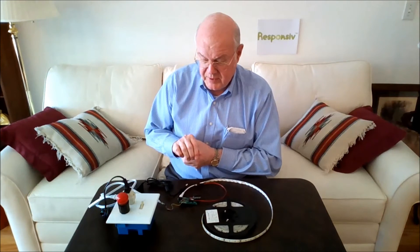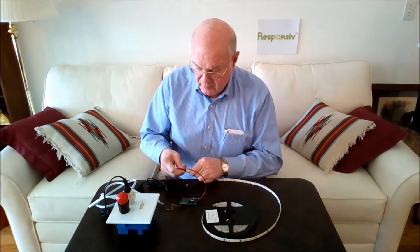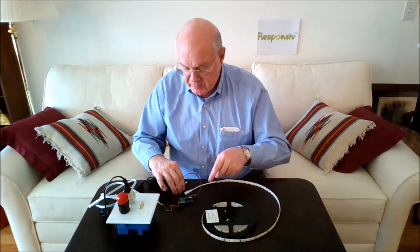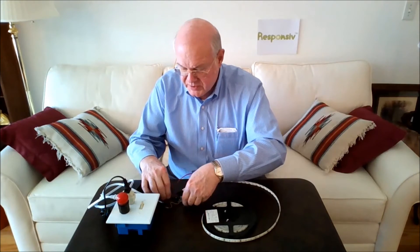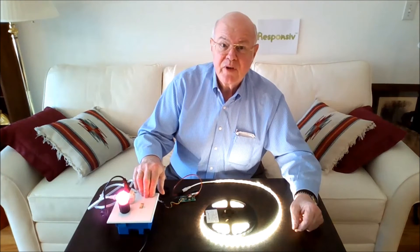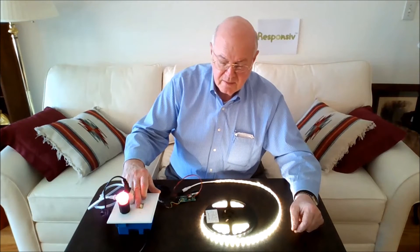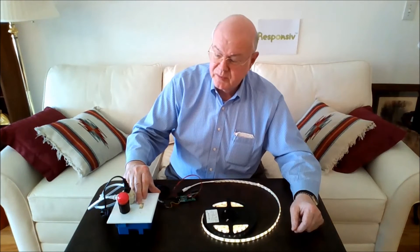The basic scheme is that it will detect those characteristics imposed by the triac dimmer and generate appropriate pulse width modulation for the LEDs. I'm going to plug the output of our adapter into the LED strip and the output of the power supply into the adapter. When I switch on, you see that the incandescent comes on immediately. The LEDs come on after a small startup delay from the power supply. And now as I pull the slider down, the bulb and the LEDs dim with approximately the same profile.